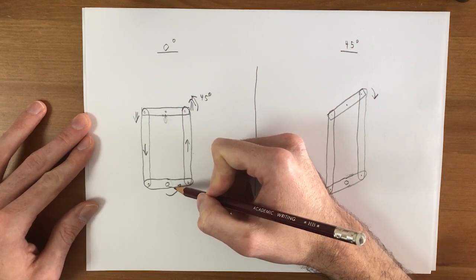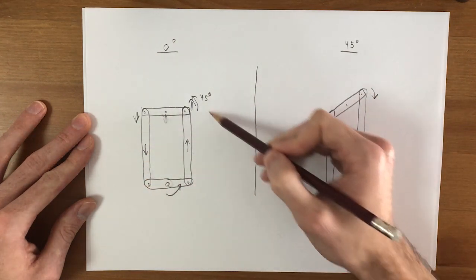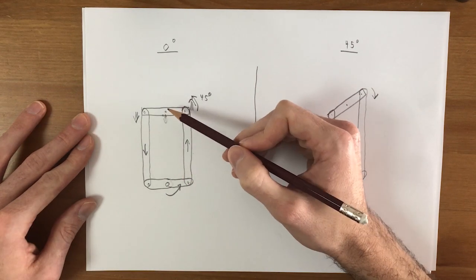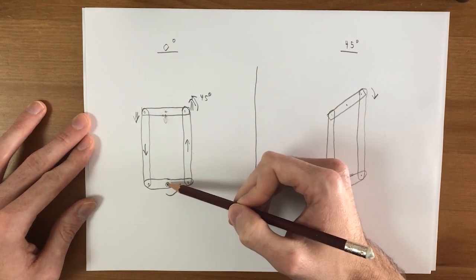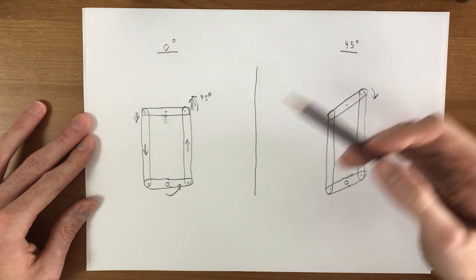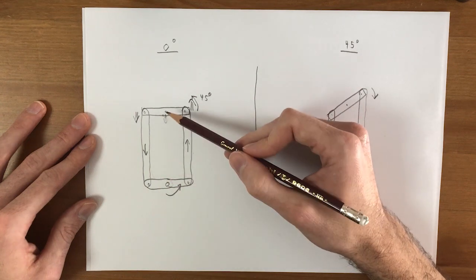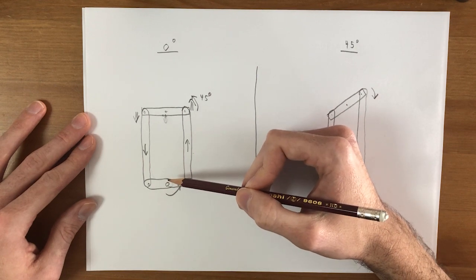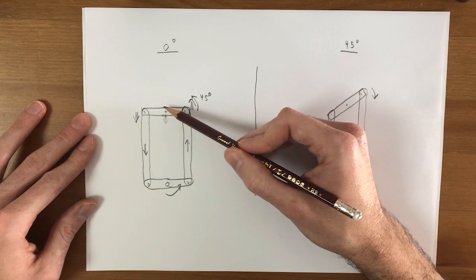But there's a catch — in physics and engineering there's always a catch. Because we now have a closed geometric loop, there are geometric constraints between the position of the hinge here and the position of the servo motor shaft here. I'm not going to go into the details, but in short, because of these constraints between the position of the hinge and the position of the servo motor, we have to be careful about how we attach the hinge to the rest of the interstage.